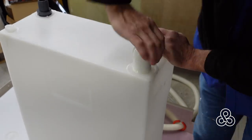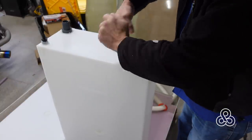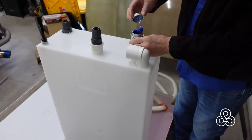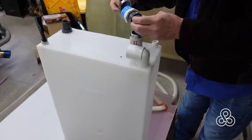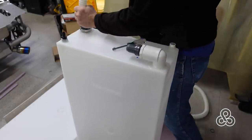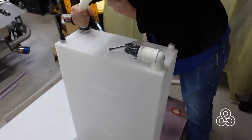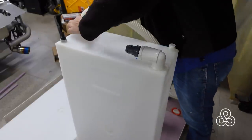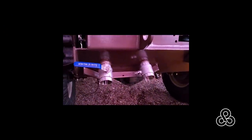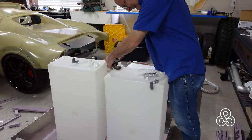This is the gray water tanks, so we have larger fittings here coming in — just some PVC adapting down to some barbed fittings, because all of our hose is going to clip onto these barbed fittings. This large hose is going to feed in from the toilet, the shower, and the sink, and also feed out to the drains. These drains for the freshwater and gray water tanks all go to the back bumper, where there are some valves built right into the bumper — you can open them up at your disposal times right out of the rear bumper rather than climbing under for anything.